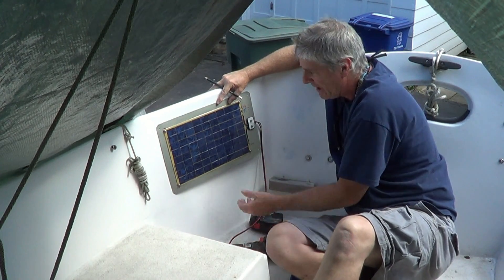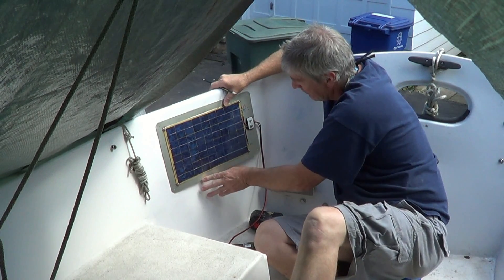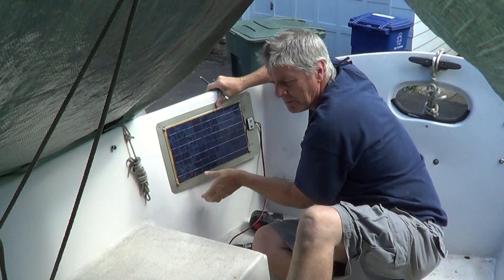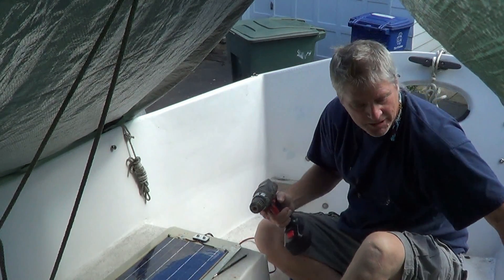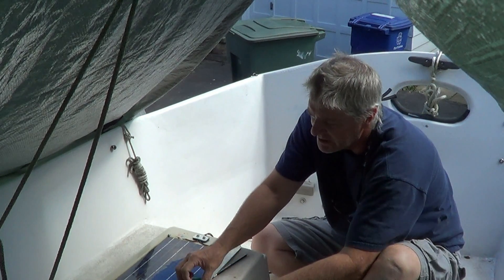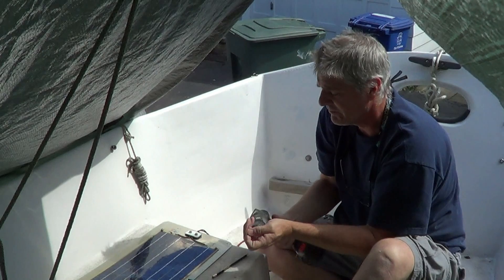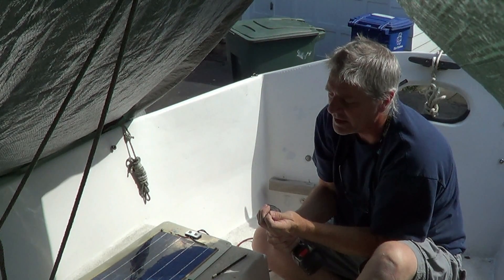I have a seat that goes right here and then the battery goes underneath it. I'm just going to mark the two top holes right now and then make a small pilot hole — very small, something much smaller than the actual screw but just something for it to get started in. That'll help keep you from cracking any of the gel coat on your boat, on the fiberglass.